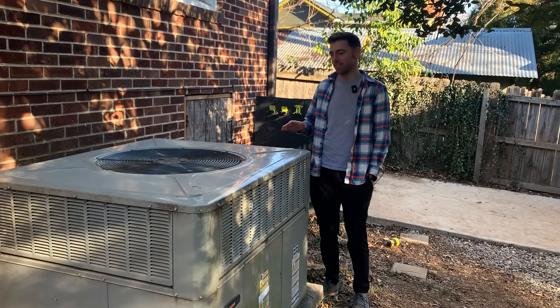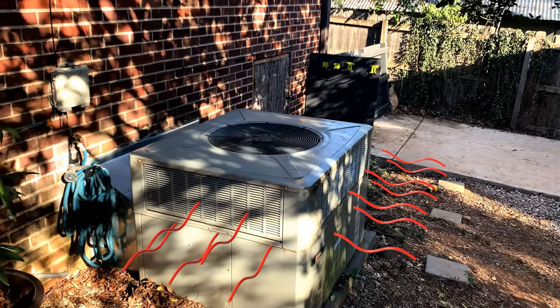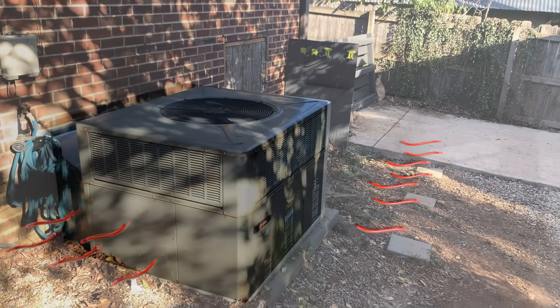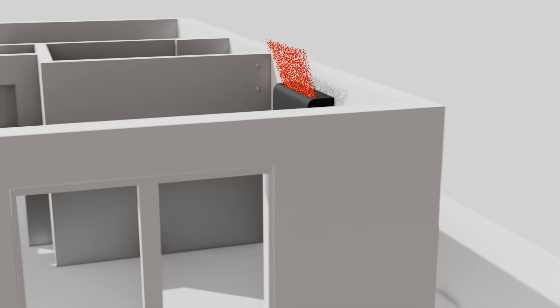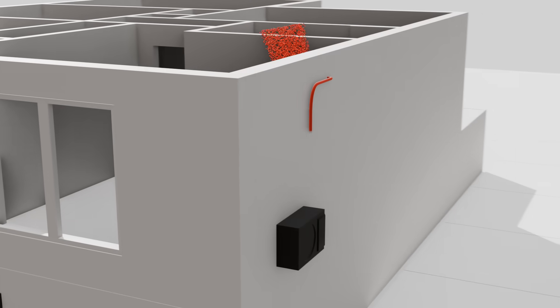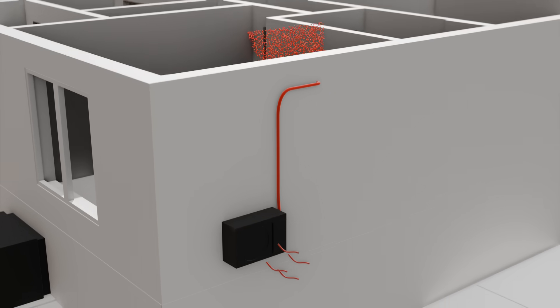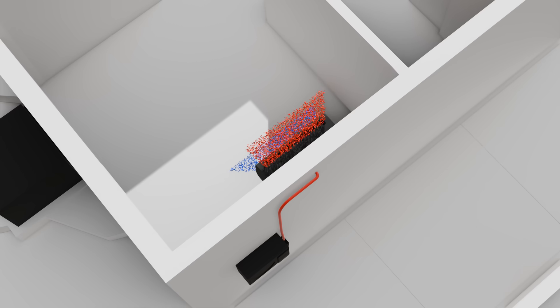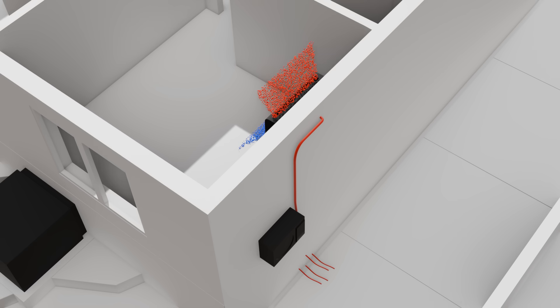But getting back to this unit, there's a reason it's located outside. When we're cooling air that passes through it, we're accomplishing this by absorbing some of its heat and releasing it. If we just released that heat back in the room, we would have no effect on the temperature at all. So to get around this, the mini split still needs an exterior unit. We're collecting the energy right in the room, but we pipe it outside before we release it. That's why it's called the split system — one part inside and the other half out here.